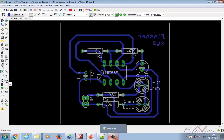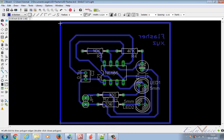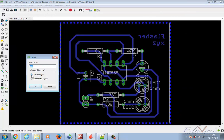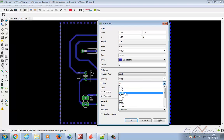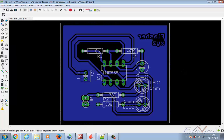Under your text tool you have an arc tool, and under that arc tool you have a polygon tool. Select the polygon tool and begin tracing along the edges of your board — that's basically the white border. When you complete the trace it changes into a dotted line. Right click on the dotted line, use the name tool, and give the name as 'ground'. Say OK. Again right click on the polygon, go to properties, and set the isolate to 0.016 and say OK. When both settings are done, use the ratsnest tool and observe the changes on your board.